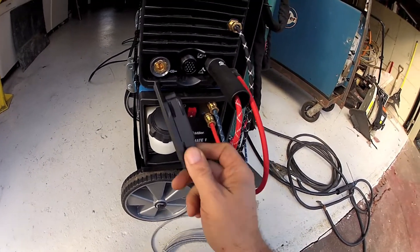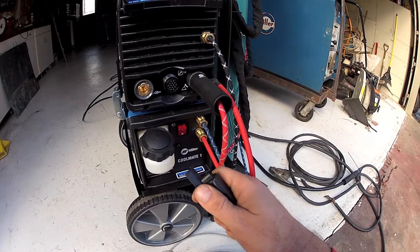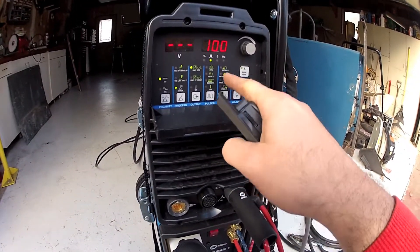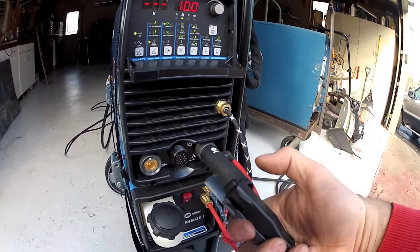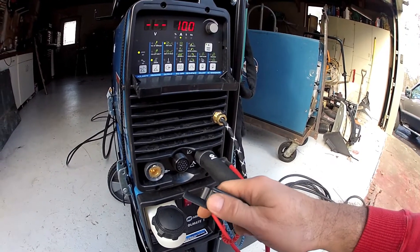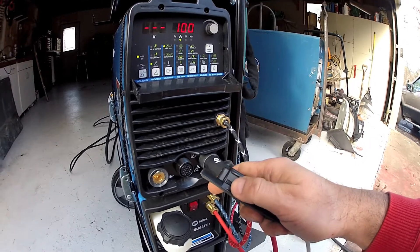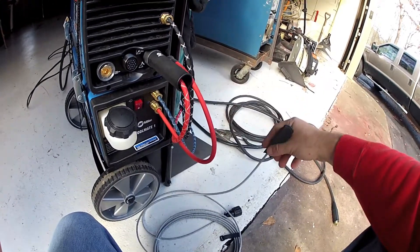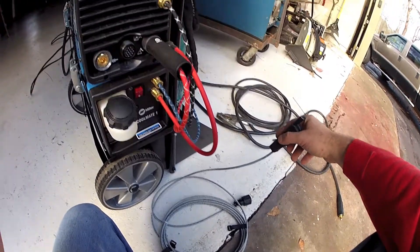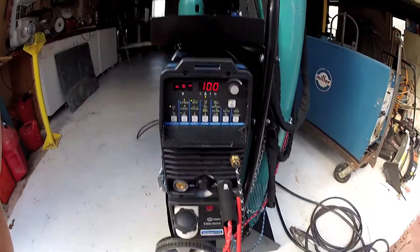The particular package I bought spent an inordinate amount of time talking about fingertip control. If you're wearing heavy welding gloves, using this little rotary dial as fingertip control is going to be a challenge in manual dexterity. Most of the manual for the DX package is written to utilize programmable ramp-up to welding amperage and ramp-down to final amperage settings, all based on one momentary contactor. I don't have the manual dexterity to use this rotary switch to control on and off amperage while feeding rod and maintaining torch distance without tungsten inclusions. So bad design on Miller's part — they were able to unload about a $200 fingertip control system to me, which is probably going to sit in the toolbox until I sell it on eBay. I'll have to buy a single momentary contactor style instead. The torch head itself is really nice and ergonomically significantly smaller than my previous torch heads.